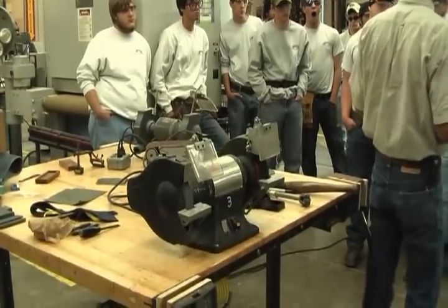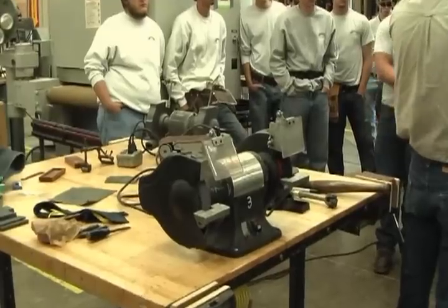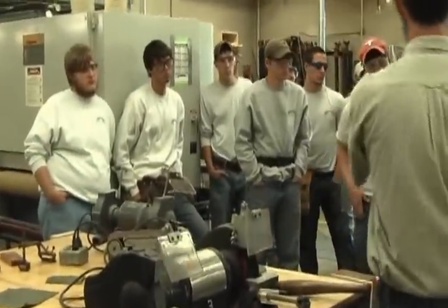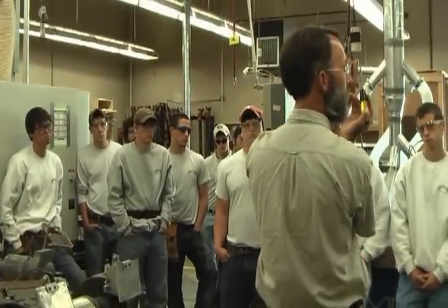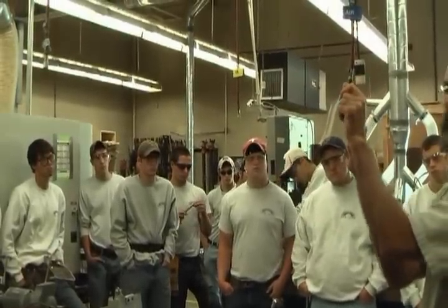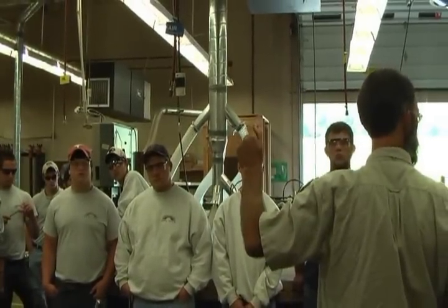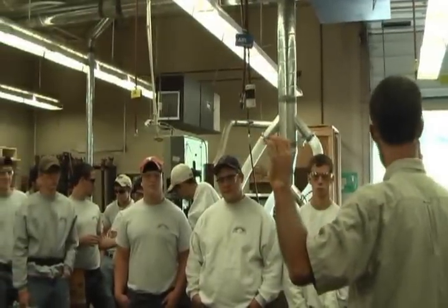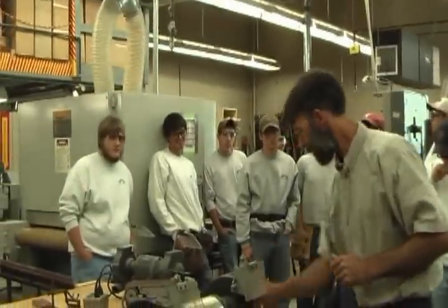If you're teaching somebody else to sharpen, you don't want them shaving hair, because they start drawing blood and then they go, he told me to do this. You can use the chisel and actually use it to bring up curls on your fingernail. All right? If you do that and it's dull, it'll just slip right off. If it's not dull, it will catch. You can just bring up a little curl. If you tend to do that a lot, it might be good to change fingers once in a while. But you go through your fingernail, right? All right? So that's a safer way to check it.